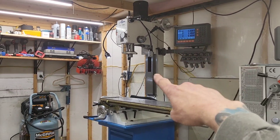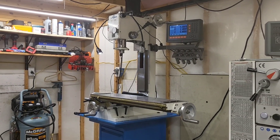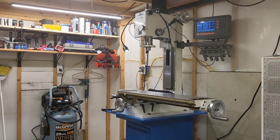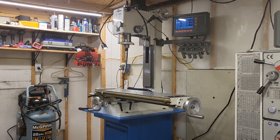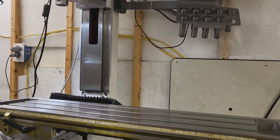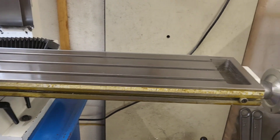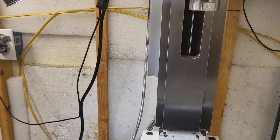I have the head extended and I got the way covers off. I've wiped this mill down and completely shop-vacced it. There's no debris on this mill. All the ways are wiped dry of oil and debris — there's nothing on it. The table's clean. We'll do a little stoning of the table today. As you can see, the ways are super clean.